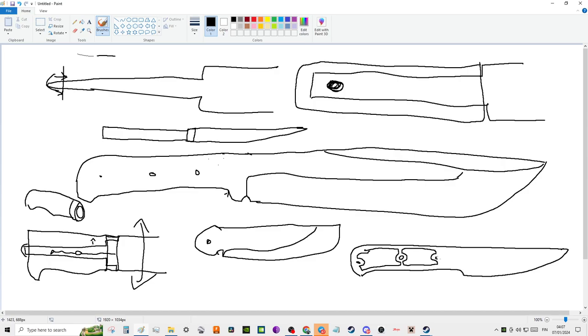We do this because of ease of manufacturing, but we also do this because it's light. But the thing is, I think personally what often the mistake is with this type of construction, why it's weak, is look how little material you have here and there, and that's always where they break. So you've got to be careful. If you're looking for the toughest, strongest blade, definitely avoid skeletonized handles.